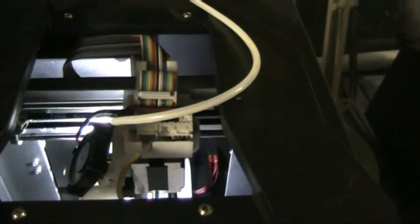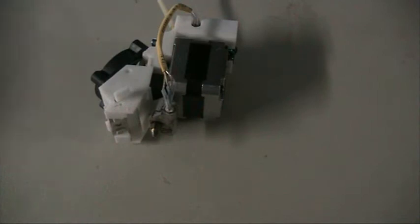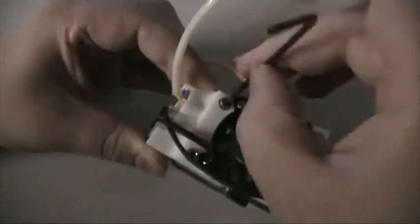At the top you're able to shut down the machine and remove the ribbon cable. As you've set it up, it's attached by magnets, which is pretty clever because when the bed ever hits the nozzle too hard, being able to separate via the magnets prevents components from shattering. We can dismantle it quite safely and you can see where it's sitting and have a better look at where the damage is occurring.